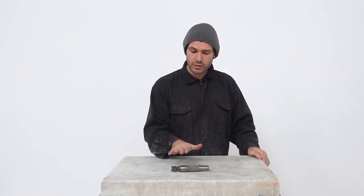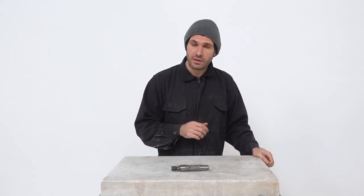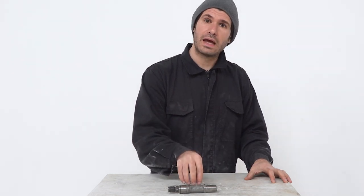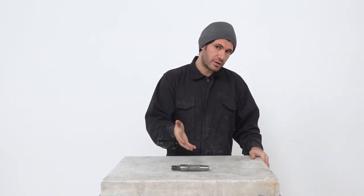The last thing is to store your hammers properly. In a previous video you saw how I created a special box just for my pneumatic hammers. After using them it's important to wipe them clean with a lightly oiled cloth, and it would also be nice to store them wrapped in a lightly oiled cloth. This will prevent moisture from getting into the tool and consequently prevent oxidation of the elements inside. And again, do not attempt to open them up yourself unless you are willing to lose the warranty.